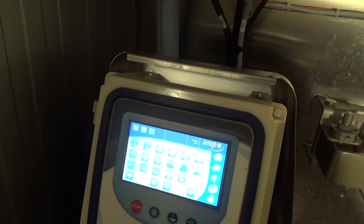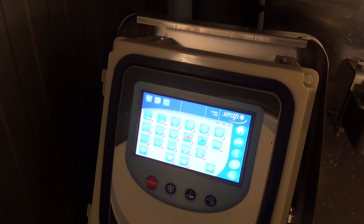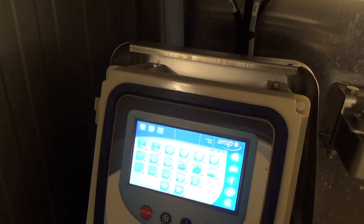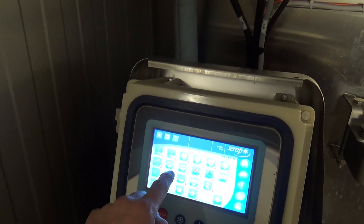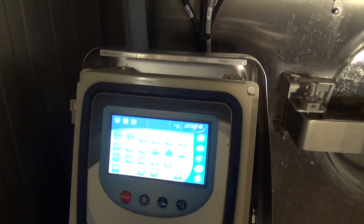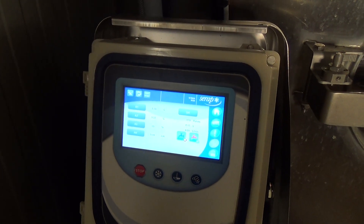You can see how easy it is to work on — without remembering the book, you can just find your way through to where you want to be. Just don't change any parameters or anything. We could turn the coolers on, we could try that. Paddle — it can run in either direction so you can check that. Wash pump — I think it's a drain valve, might have two dump valves. Some of them have an option for a second valve to separate wash water — clean from dirty, or milky from chemical. On this one there's a flow meter, so if we turn the hot on again — there we go, 19 litres a minute.